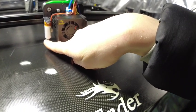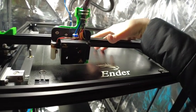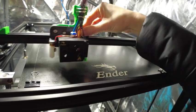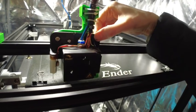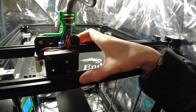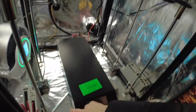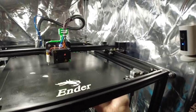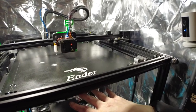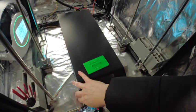You can see the BL Touch has deployed itself — I just stuck it back in. If the extruder is sitting over to one side and you turn it on and tell it to go back to its home position, because it's starting in the wrong place it might run into the edge. If that happens, just switch it off at the switch. Flick it off, then bring it back to center manually. If the bed is doing the same thing, you'll hear the motors going — it's not good to leave it running as it will damage them.